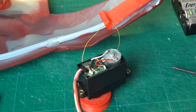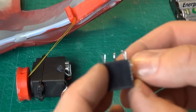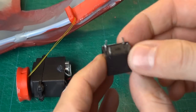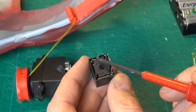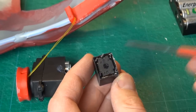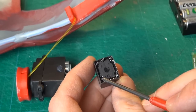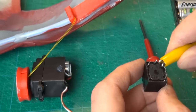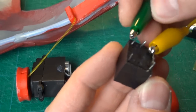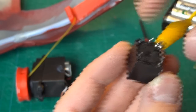The way I'm going to do that is with one of these — a relay. This is a magnetically operated switch. This one's out of another project — hence the bit of sticky pad stuck to it. It's a 6-volt relay but it should switch fine at 5 volts. It has a changeover contact: one common contact which connects to one terminal when it's off, and when the relay is energized it connects over to the other one. You energize it by putting power across its coil terminals — you can hear it clicking. So basically it's a solenoid-activated switch.